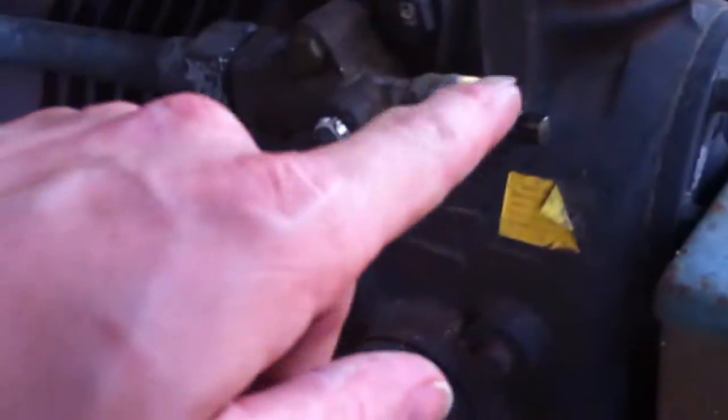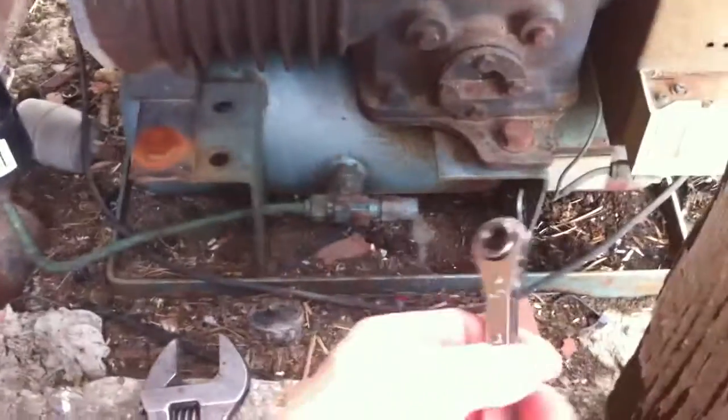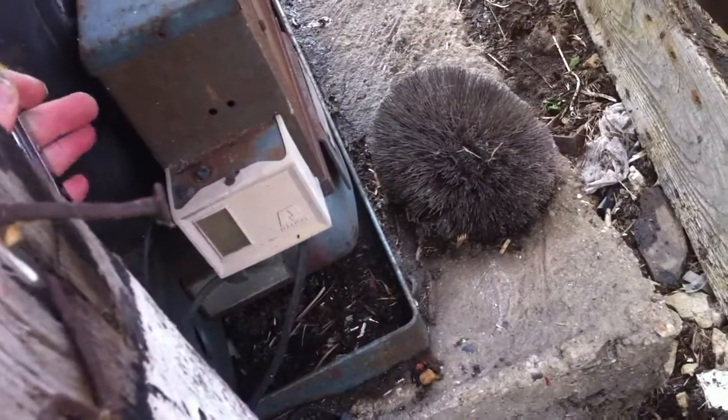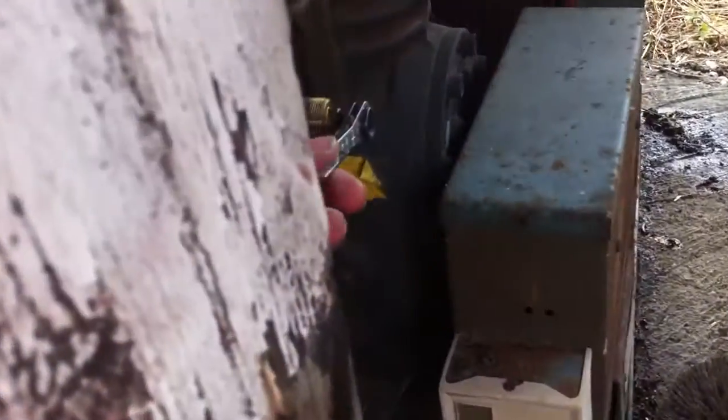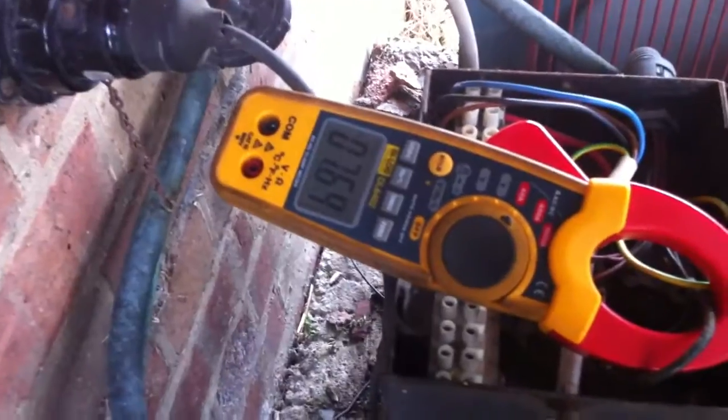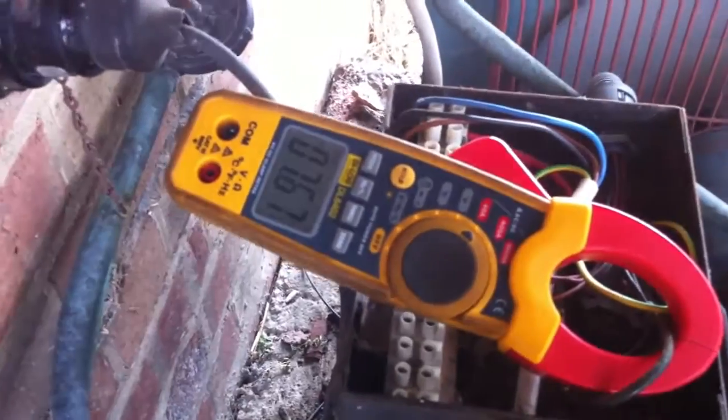What we've done is wound the suction valve in, because the water in the ice builder was at 30 degrees C. We've drained it out and put some cooler water in at about 25 degrees, and then to get it cold we've wound that in. This is designed to run around 0 to minus 10. We'll open that up a bit now, see the run current come up, and see how that runs.